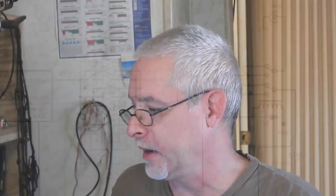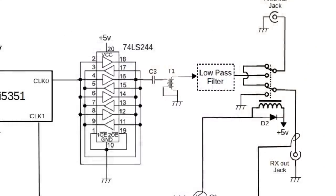My build will be down the road because I'm still waiting on parts. I thought I had all the capacitors I'd need for the low-pass filter, but going through my parts bin I did not. Back to the schematic — then we've got the low-pass filter, and we'll talk about that in more detail in just a moment. And finally, the relay — that's just a little 5-volt double-pole, double-throw relay. I think I've got the Jameco part number on there: part number 140290 through Jameco.